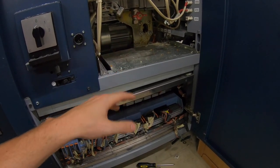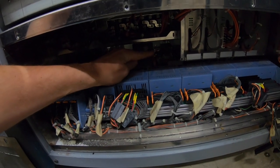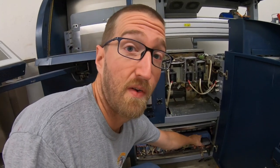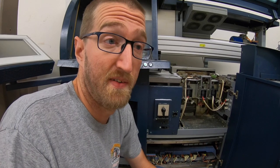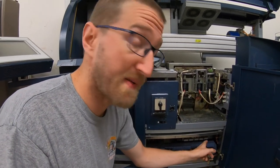And I checked all the relays in the back, I looked at the schematic, and I could not find the relay. And I mean, it's acting like the solid state relay that I replaced. There's a solid state relay back in that I replaced for the glue pot, and it's acting the same way. So I just talked on the phone, and he'll be out here tomorrow, but he confirmed that it is likely the relay, and there is a relay located on this module, and that's probably what burned up. And that makes sense, because I smelled the smell of defeated electronics, and that makes me think that there's some sort of a solid state relay in here that I should be able to desolder off there and replace instead of changing that whole module or buying that whole module, which I have no idea what it costs.